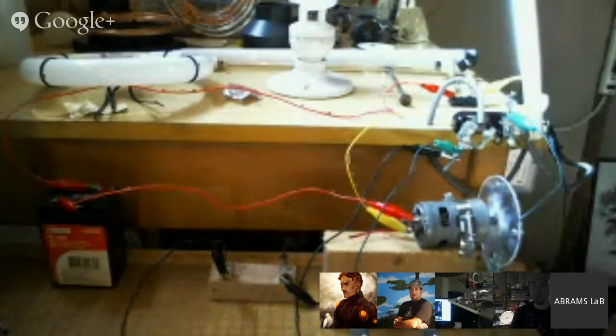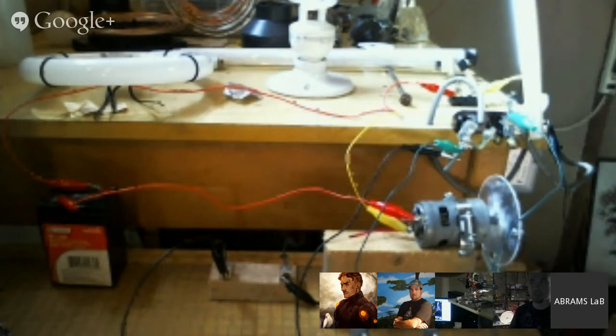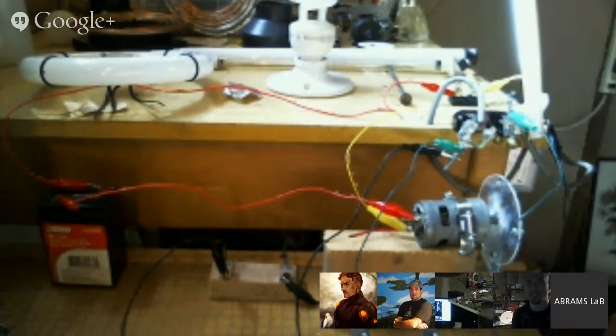And I haven't set up the hairpin with the new NSTs that I got to where it has two grounds. If I set it up to where it has two grounds, I'd like to see if it shorts again, because then I think it was Energy Fabricator who was talking about how it could be feedback from the actual NST that's creating a sustained oscillation and not just shorting out to ground. So it'll be something I need to investigate to see if it was just my old NST. Because like I said, that old 5 kV NST didn't have a center tap ground or anything like that. It was just a dangerous one-wire NST, basically.